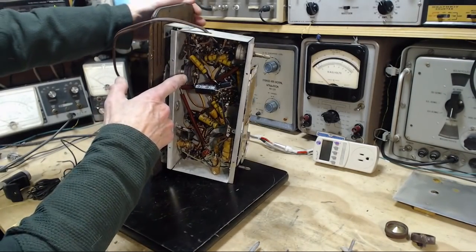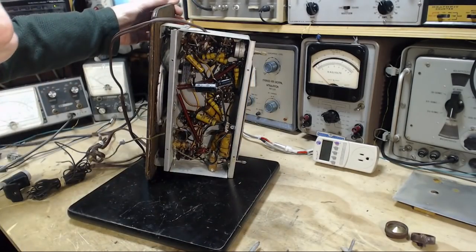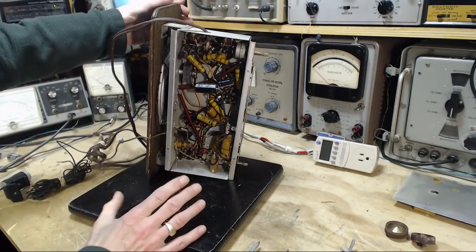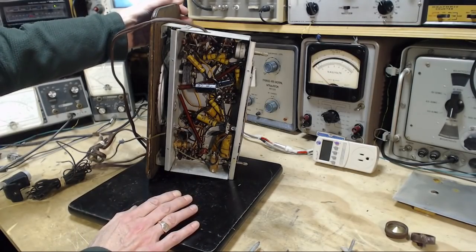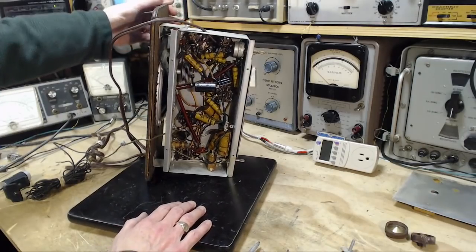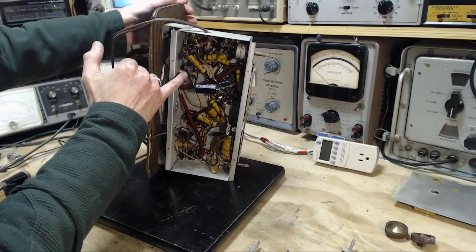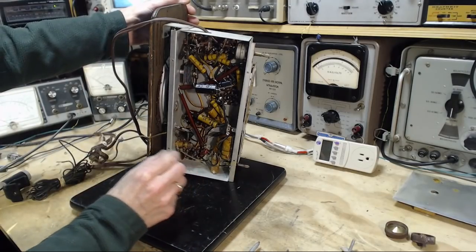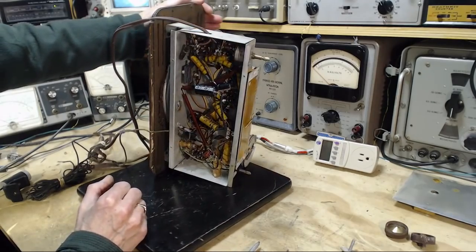So we'd see some kind of almost direct connection to this guy if he's the power rectifier. Don't know what else it would be. It's pretty large. Occasionally, these radios have a separate negative supply for the grid, but that would be very unusual. I mean, especially in a small radio, they might find one of these tucked in it to rectify for bias voltage, but that's unusual.